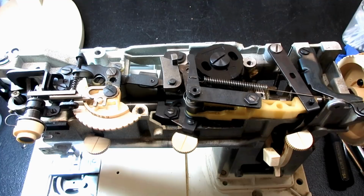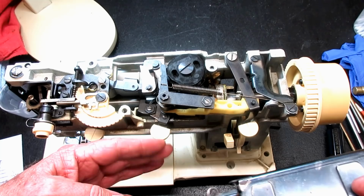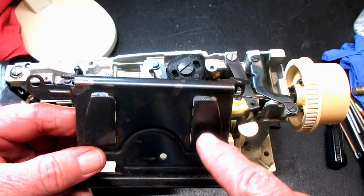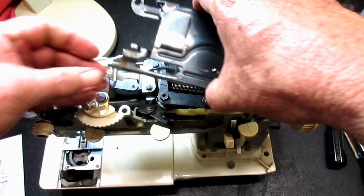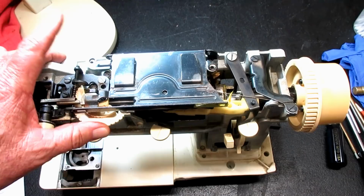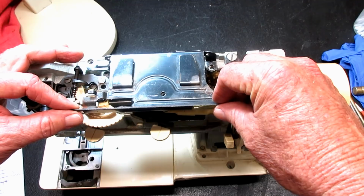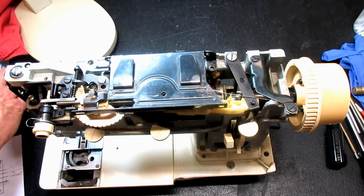Okay. Now let me get the handle bracket, and we'll finish this up. All right. So with the machine facing you, you put this back on. You know those clips for the handle face the back. Of course, if you put it like this, you're going to find out they don't match up, but just to save you a little bit. And we'll set it up there and line up those holes. Don't forget, this tension dial has to be all the way to the left so you can see the one in there. And I hope that you have all 4 of the screws, and you have the one that goes right there. That'll just make yours a little bit stronger than mine. I'm not worried about that,